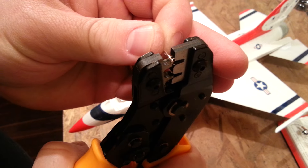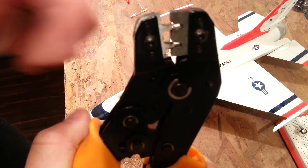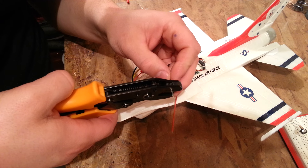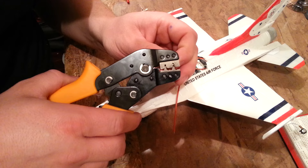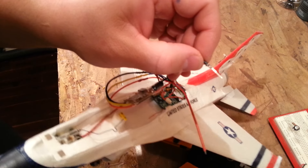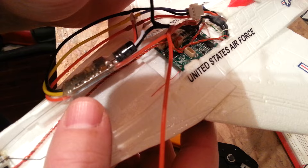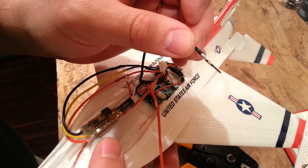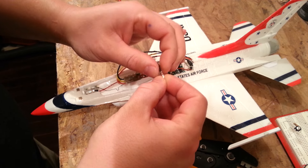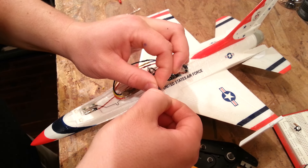First thing I do when building these is break them off the strips. Second thing I do is identify if I have this thing loaded in here right — find which side is lower and which side is higher. I get this started by just kind of squishing that in there. See how it's biting in there now? Line it up all the way to one side. It'll click and you can feed your wire in that way. I'm just pushing it through until I see the copper come through. You can see how it's got a little bend to it — I always straighten that back out.